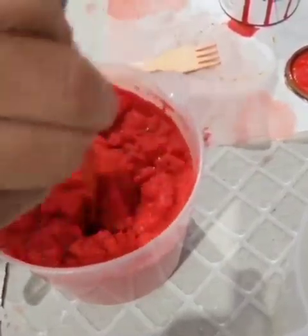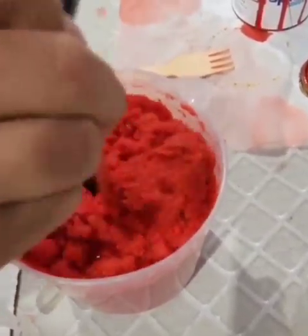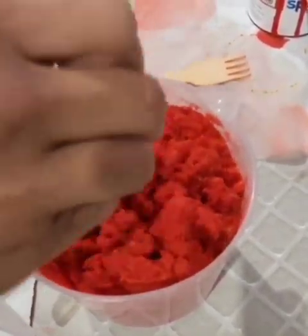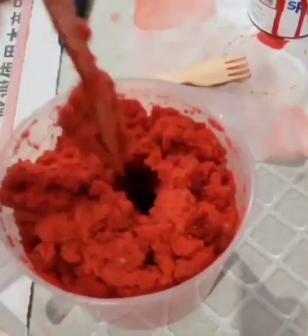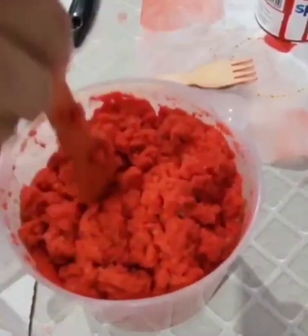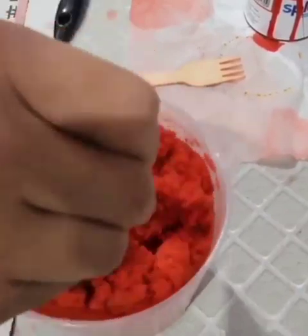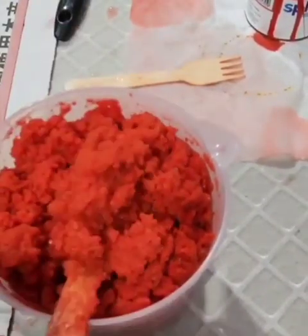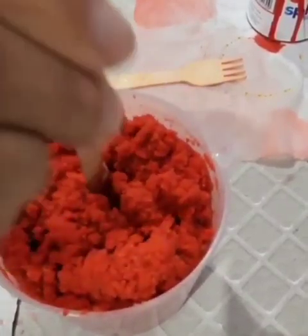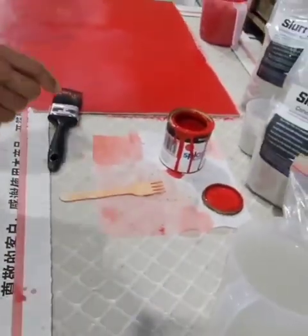That'll thicken into like a jelly, like a grainy jelly, and it passes an international paint leaching test, which means that once it's encapsulated, once it's in this solid state, even if it rains on it, it won't leach out any paint or any pigments or anything like that. It remains encapsulated within the slurry dry or bentonite clay. That's done. So that's if it's really thick and you want to get rid of it.